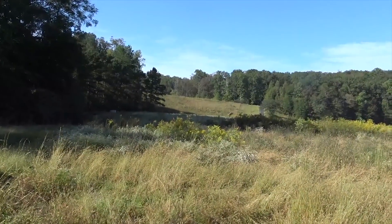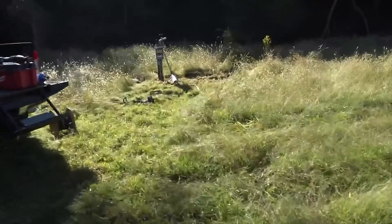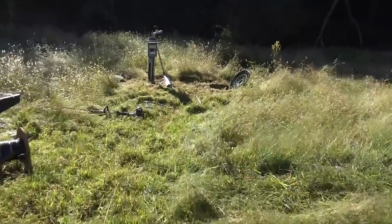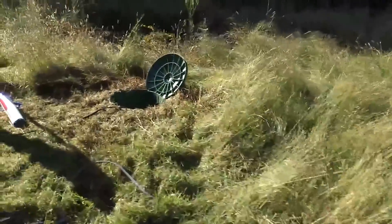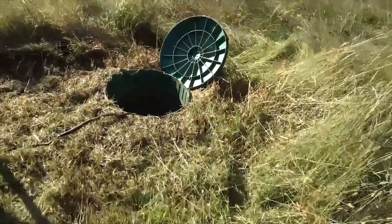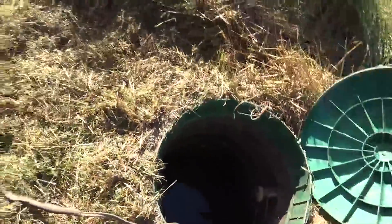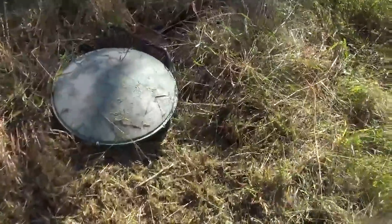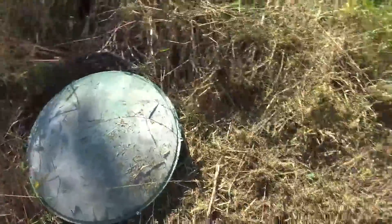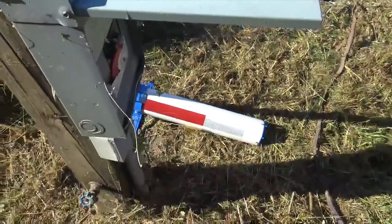We're trying a different pumping technology — a Franklin pump. I've showed you the flow sleeve combination. There's a lot of groundwater that ends up down here, being collected in these septic tanks — thousand-gallon concrete tanks. This one is an AC pump and we're not going to mess with that today. Our goal is to switch technologies.